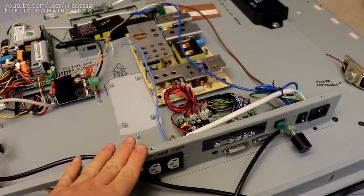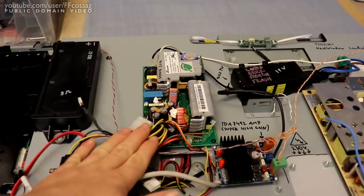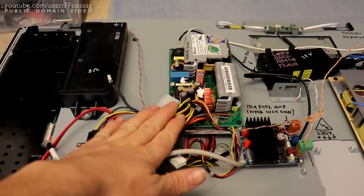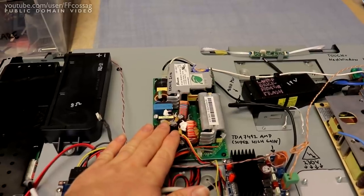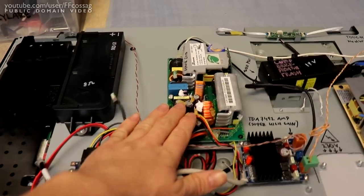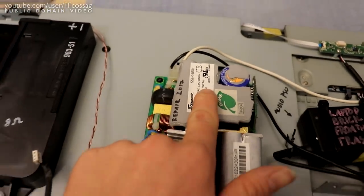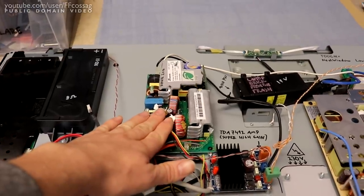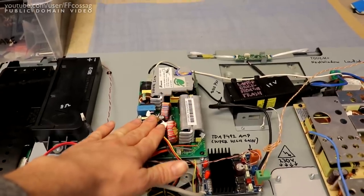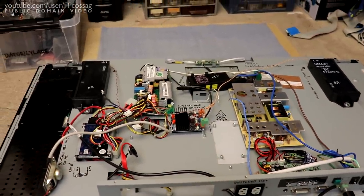What is perhaps going to be a bigger deal is the power supply, because I've actually measured the power consumption of the new board and it is a tad higher than the original. This power supply is a Seasonic SSF-160U1, rated at 160 watts, but it's only rated for 8 amps continuous on the 12-volt rail and 11 amps peak according to some Chinese datasheet. The new board draws about 8.5 amps under load, so that poor power supply is going to be a bit toasty.